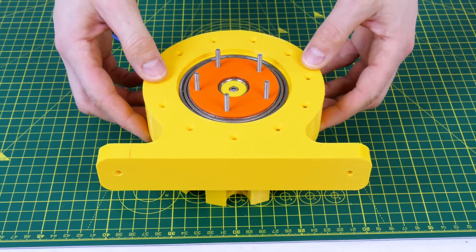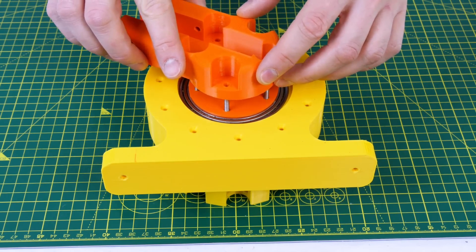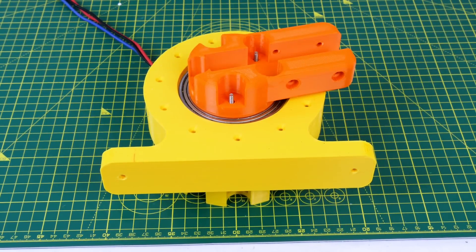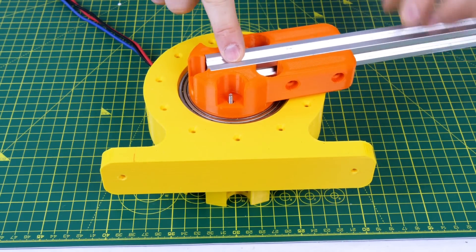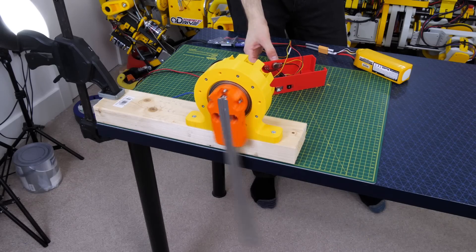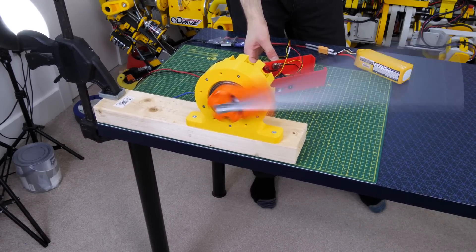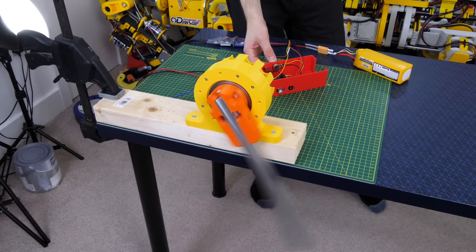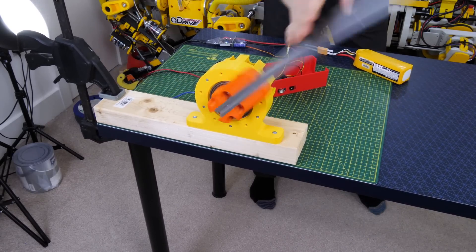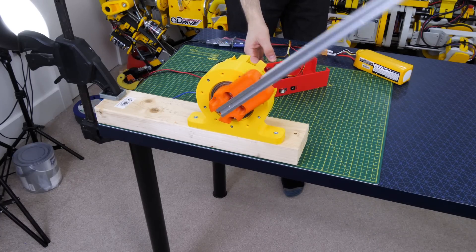It's time to make a bracket to hold that motor that I can screw down to the bench, and also a piece to attach a lever to which we can attach some mass. I've made a piece which will take a piece of 20/20 extrusion so I can vary the length really easily. We still have a 10 to 1 reduction, so no doubt that will be fast enough for a robot dog's leg joints at both hip and knee. If I try to stop it with my hand it feels pretty powerful — it'll probably take my fingers off if I wasn't careful.